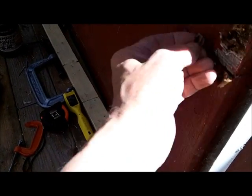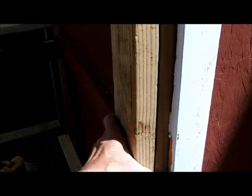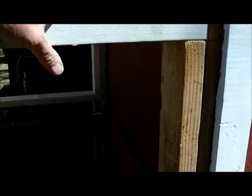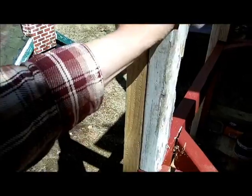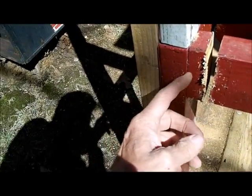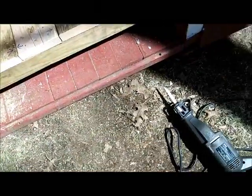All I did is just pull it out of here. So now I can put another 2x4 and continue down. Couldn't do this before. I couldn't put a straight piece down in here because I needed the support. Otherwise I'd never be able to nail or do anything on this. So now we just got to remove this here, and then remove this little piece, and we'll hacksaw the nails off. As it is, I might have cut through the nails on that blade.